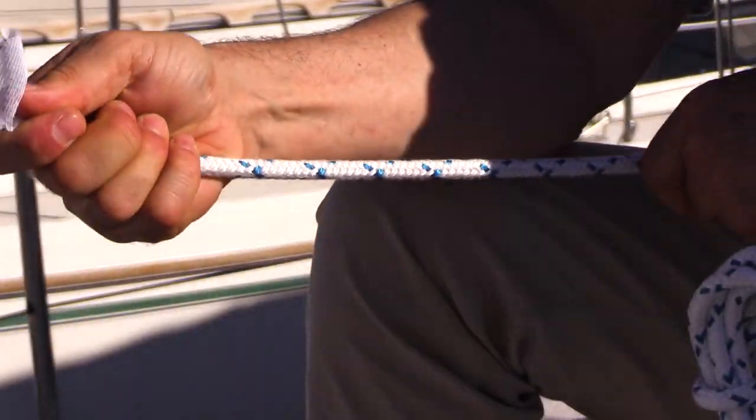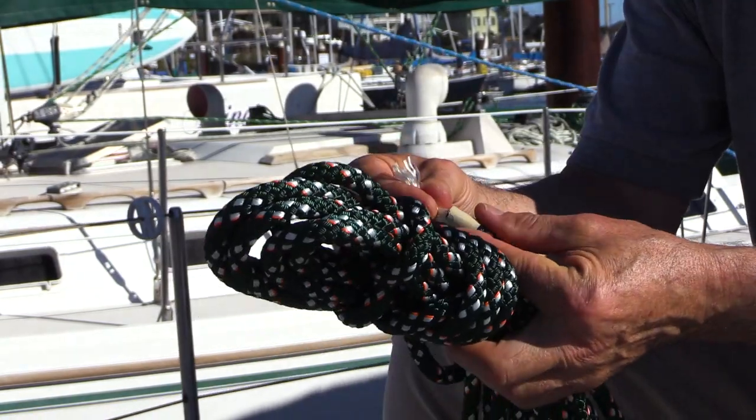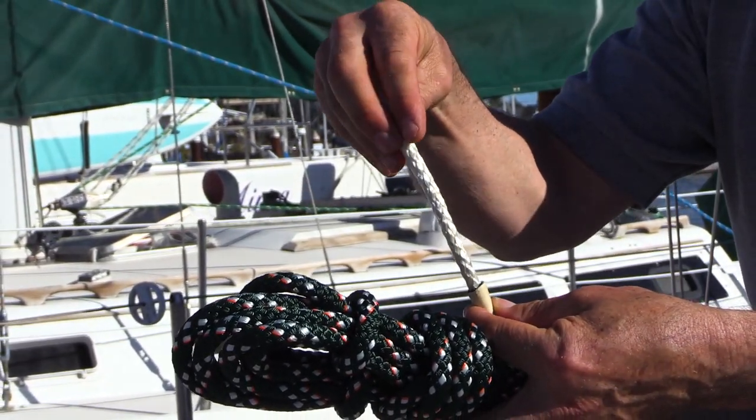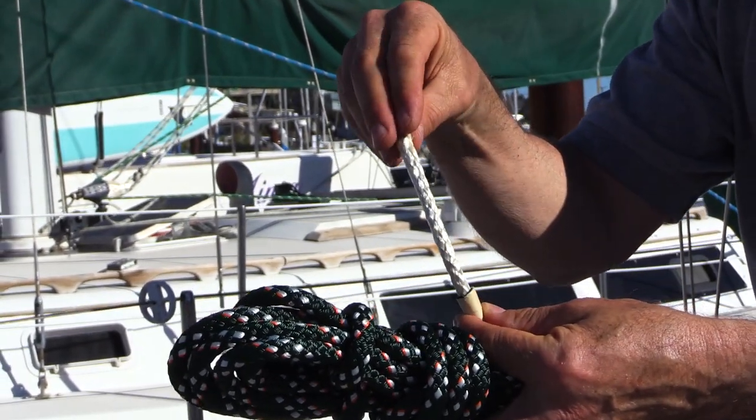From there, you would go up to a blended core rope, which has a high-tech fiber in it, such as New England Ropes VPC. This has a blend of Vectran inside, just enough to really reduce the stretch, but there's a filler in there so that you aren't paying for the very expensive fiber in the whole core. You're getting a better deal there.